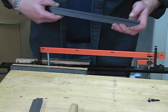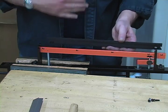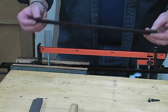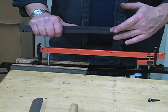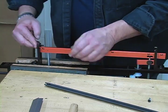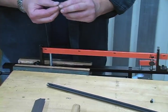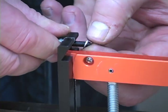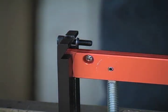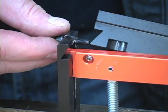Next thing I'm going to do is attach one of the blade guides. The black blade guide goes on the left side if you're looking at the crank handle. Once we set it, it is never ever adjusted — it is a permanent fixture and is a reference surface for the blade. I have two shim washers. The purpose of the shim washers is so that we can control precisely the spacing of the saw spine within this mechanism, so if there are any binding issues or a part is slightly out of tolerance, we can fix that with the shim washers.